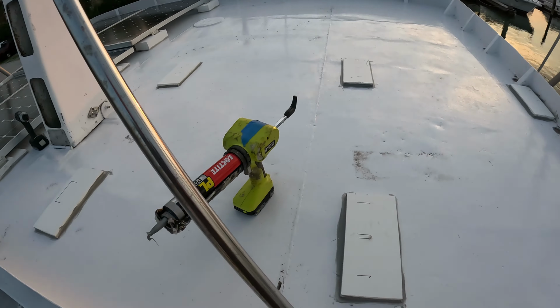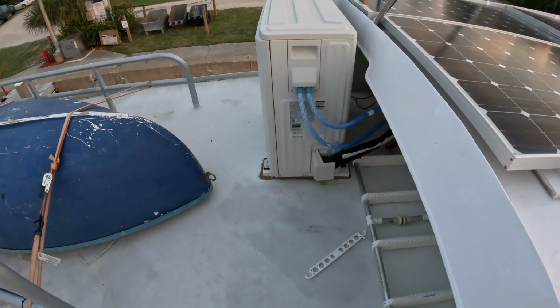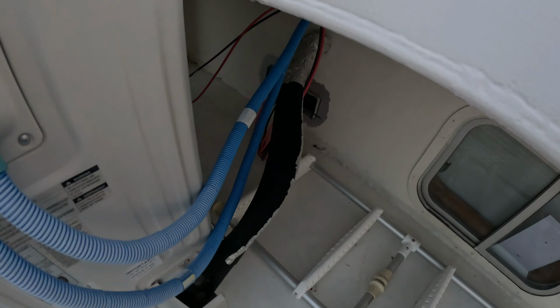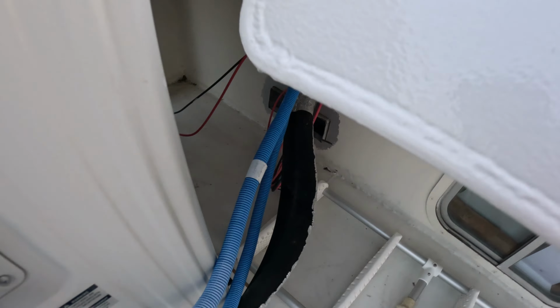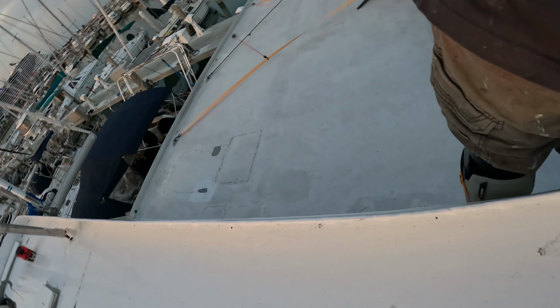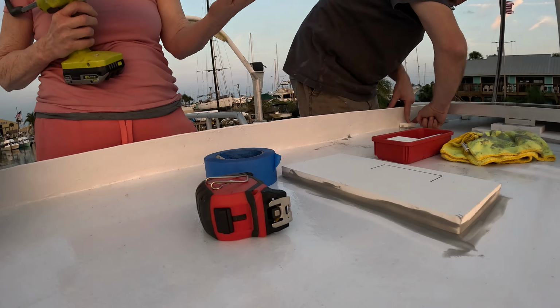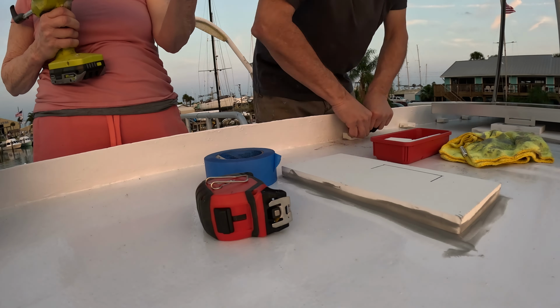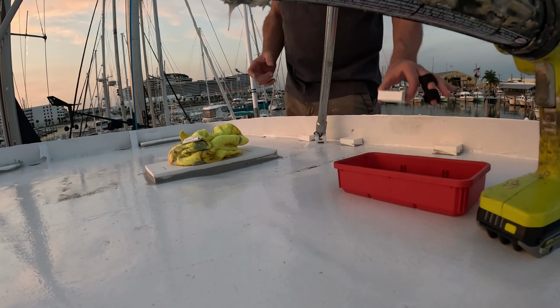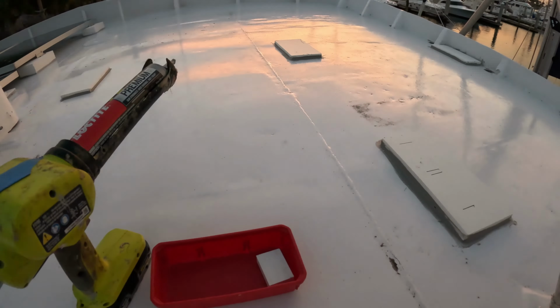There are 6 of the pads, so we'll be able to get 2 more panels in. So the extra solar wire is underneath there for this set of them. And what we're going to do is put blocks in there, all the places there's little black dots all the way across, about every foot. That'll give us a place to attach that wiring to. We just need to put some nice white loom or a piece of PVC and secure it. But right now we're just getting the blocks in place. Later. We got the wire blocks in, so now we can run the wire along there. I think we're done.